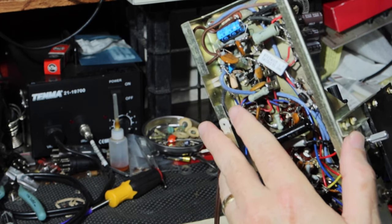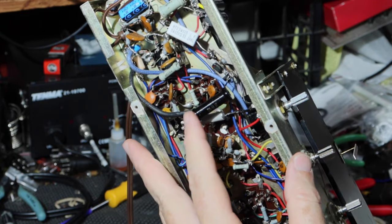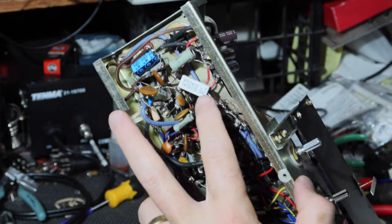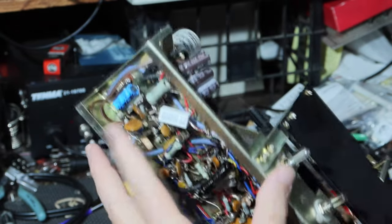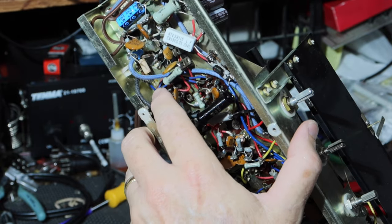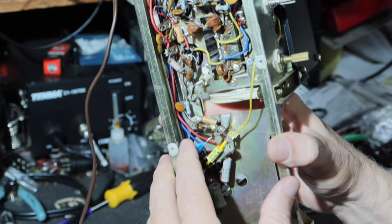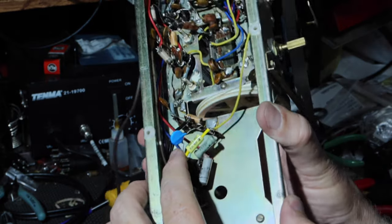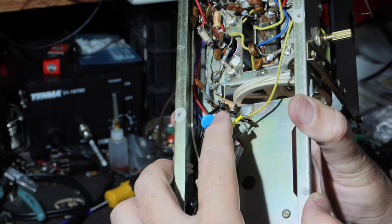One of them is this black wire that comes up, and it goes to this first power resistor, which is here. That then goes to here, that goes to the rectifier, that then goes to those other power resistor I did and the other filter capacitors. Okay. You go back to here, there's a blue wire down here, and that is the heater line that runs off down here, and it goes to pin 4 on the output tube, which is down here. When it gets down here, though, there's that 0.01 Y2 capacitor that then goes to here